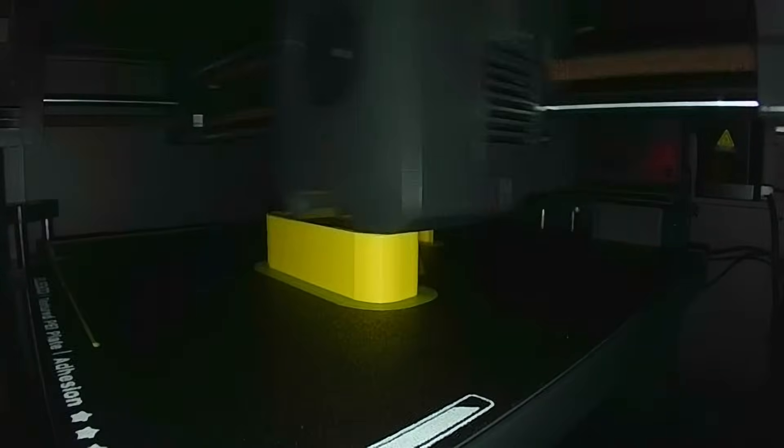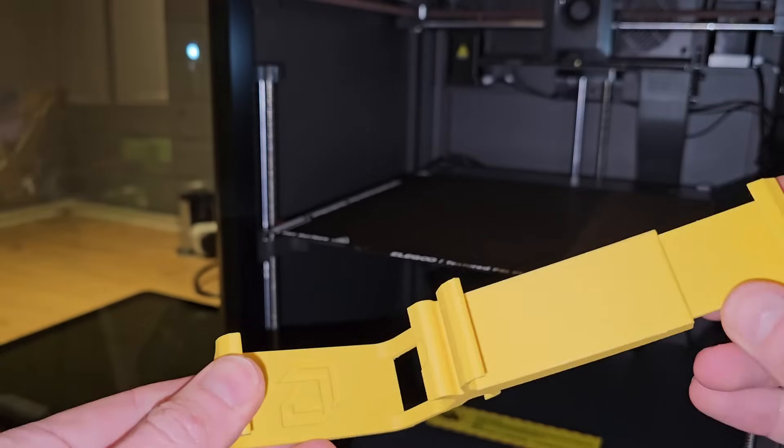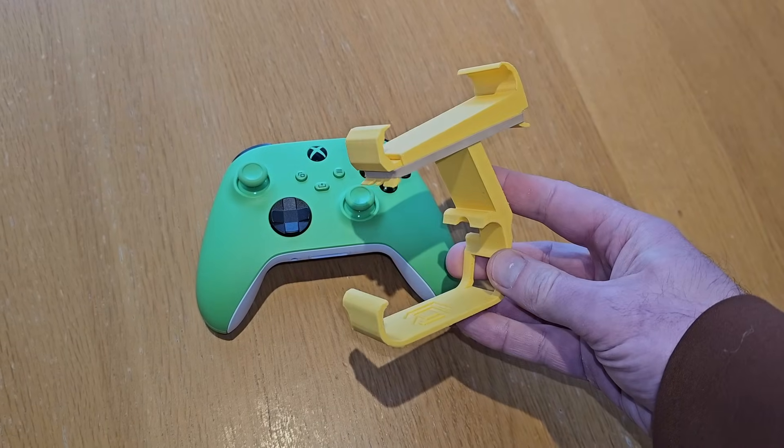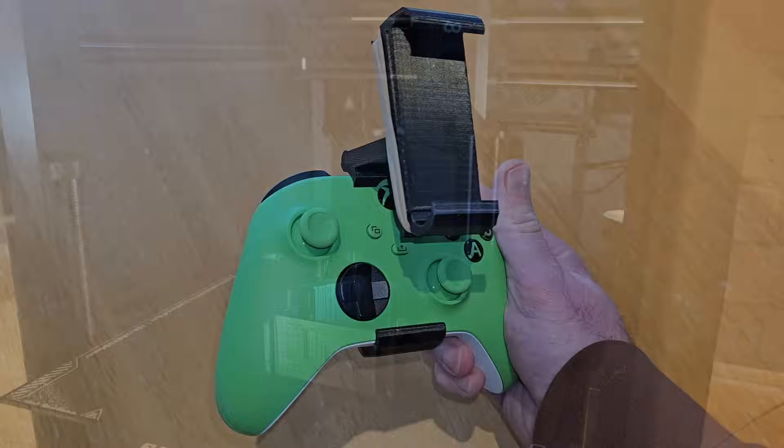Back to the Centauri Carbon. Printing with the Timori PETG-GF was no issue using the Elegoo profiles, and the glass fibre gives this PETG a much stiffer feel, almost like a stronger PLA. It's ideal for this Xbox controller phone holder. Seeing as the Centauri Carbon's nozzle can reach high temperatures, I chose to try some of Overture's PC filament, which prints at around 270 degrees and a bed temperature of 100 degrees. The Centauri Carbon's bed goes to 110 degrees, so this shouldn't be a problem. Sure enough, the PC print was very good, with no warping or adhesion problems at all.